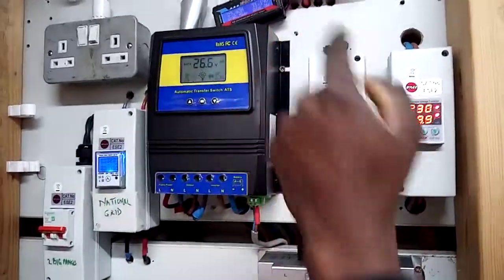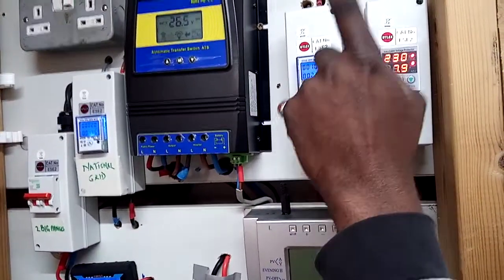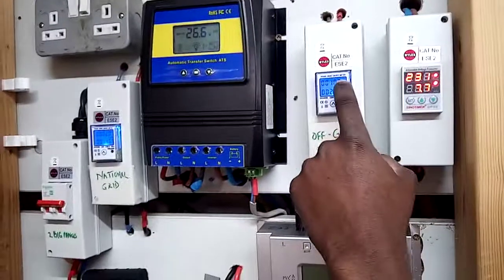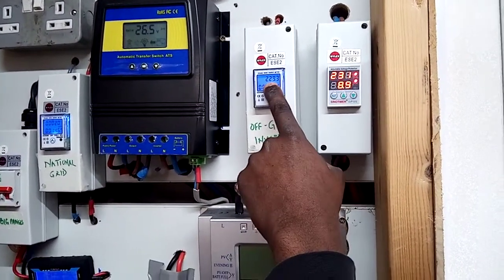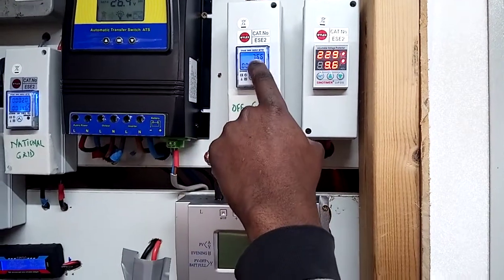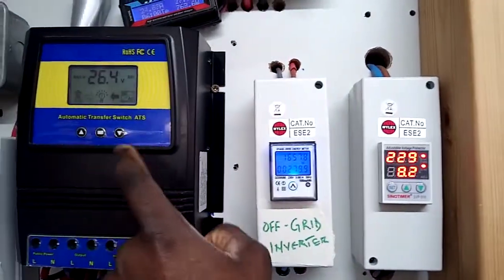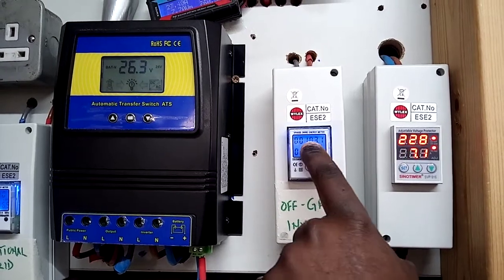I'm running from the inverter mode right now, so let's look at real-time consumption. Today is the 18th of April 2022. From the 1st of April, I've used 1103.1 kilowatt-hours total. The current voltage is approximately 229 to 230 volts AC, and I'm currently drawing approximately 7.1 to 7.5 amps AC. The important value here: I'm at approximately 1.7 kilowatts of consumption — which already exceeds the stated 1.2 kilowatt limit for my 24-volt system.